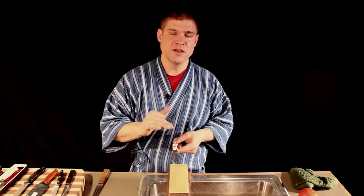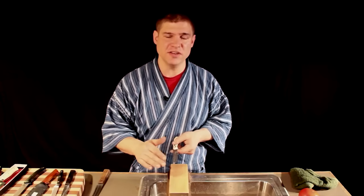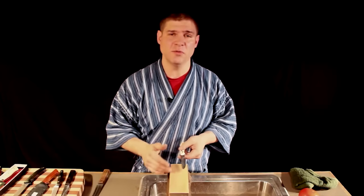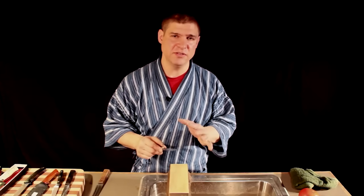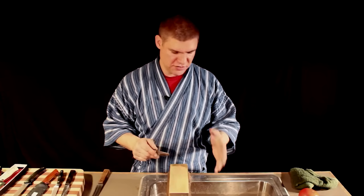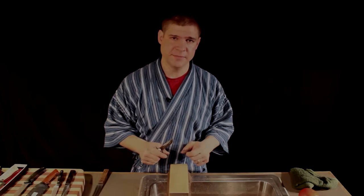And that is the evidence of your tender, loving care, is your skill will be apparent to them, that you have straightened this knife, you've cleaned it, you've assessed it for damages, which is step 3, you've thinned out the secondary edge, you've ground in a new primary edge, you've honed that primary edge, and then you finished it with a 6,000 grit stone, which was step 7. That, guys, is the 7-step procedure of knife sharpening. We've done it 3 or 4 times now. And now I need you to go into your shop, get yourself a good set of sharpening stones, and go practice, because I know you can master it.